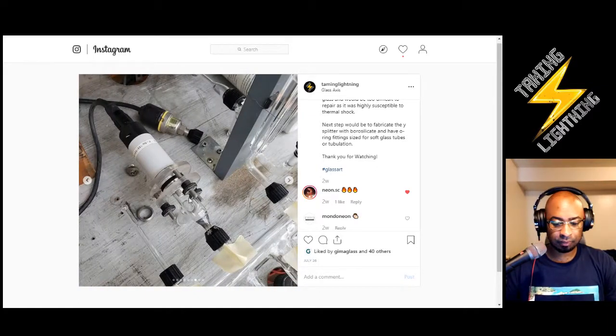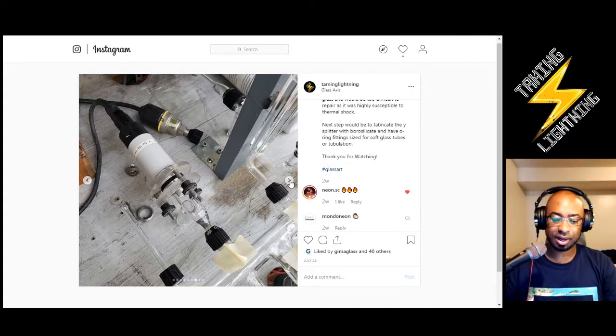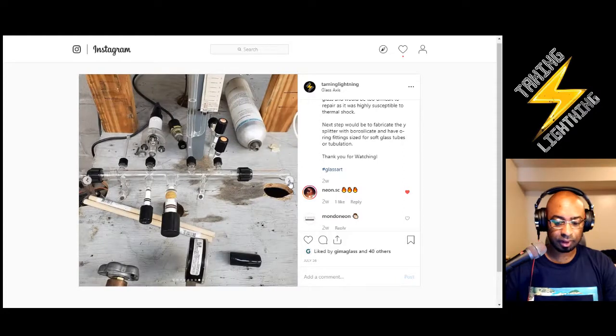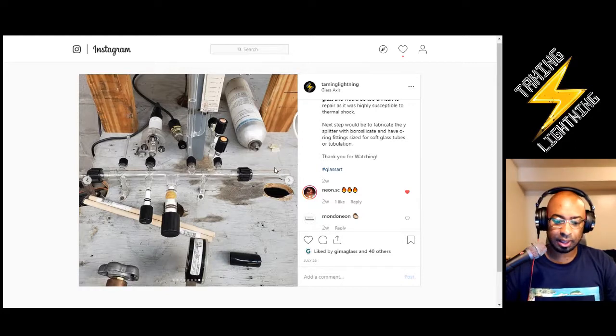After setting that up, I was able to use the sensor, and this is the gauge for the microns. It allows you to understand the vacuum below 1 torr, in the very small vacuum ranges, which is rough vacuum. You're not doing something super scientific, which requires a much greater pump and a much more sensitive sensor and gauge. So the next thing I had to do was start the leak check. Now I had a gauge that could read below a torr. I can actually see where it's pulling down to, and make sure that we have the vacuum that they said they were getting.